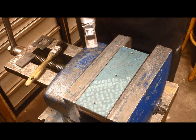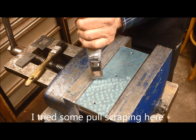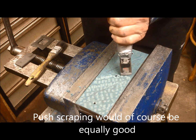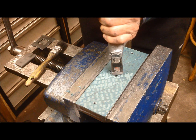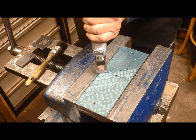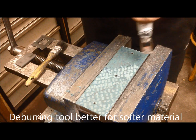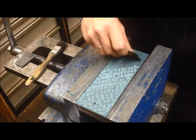And now I'm on to the test piece with Rulon again, just to go a little bit further, showing the method I used. Pull scraping. A bit awkward to fight the oil grooves there also. I used this kind of tool instead of the stone — I found this better.